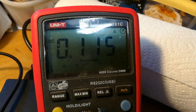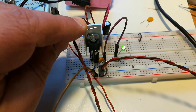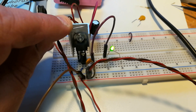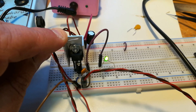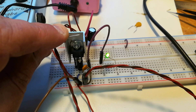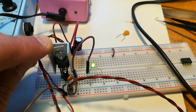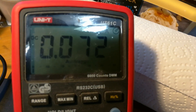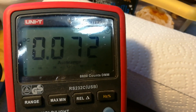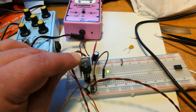The milliamps are decreasing, which means the resistance from the polyfuse is increasing. It looks wet because it's hot. I think it keeps a constant temperature of about 80 degrees — at 80 degrees it has maximum resistance. It's keeping a current of around 72 milliamps.